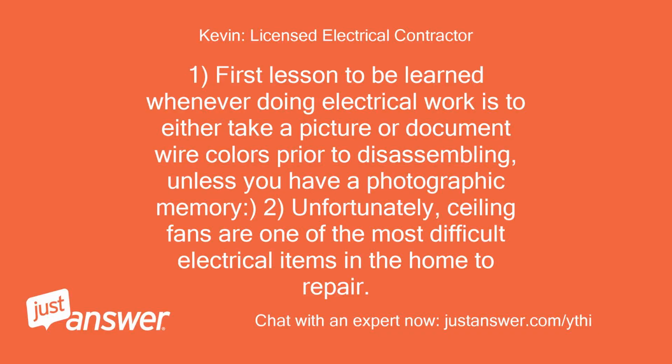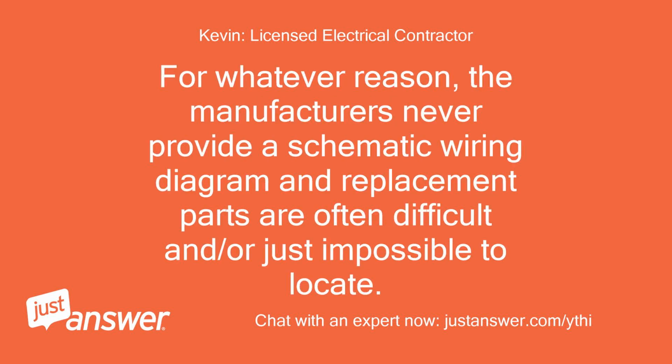1. First lesson to be learned whenever doing electrical work is to either take a picture or document wire colors prior to disassembling, unless you have a photographic memory. 2. Unfortunately, ceiling fans are one of the most difficult electrical items in the home to repair. For whatever reason, the manufacturers never provide a schematic wiring diagram, and replacement parts are often difficult and or just impossible to locate.